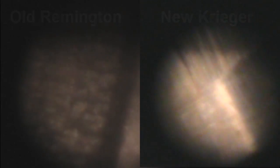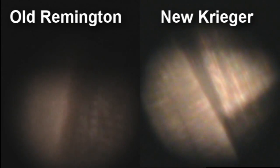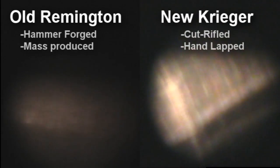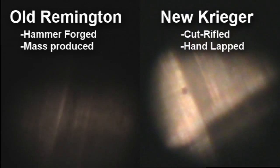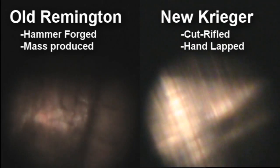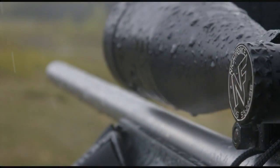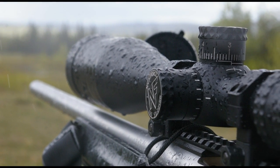Let's compare this to a brand new match grade barrel. Notice the lines in the metal. Match grade barrels are hand lapped, so all tooling marks have been removed and the lines are all in the direction of bullet travel. My Remington barrel was hammer forged and has tooling marks going perpendicular to bullet travel — it's not hard to guess which one is going to perform better. Unfortunately, this is not my new barrel. I have a new barrel on order, but it's not expected to arrive until mid-summer, so I will just have to make do with this barrel for now.